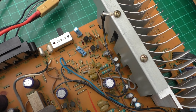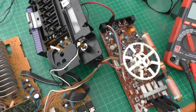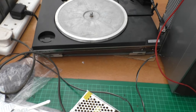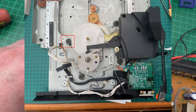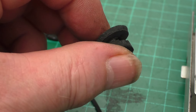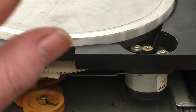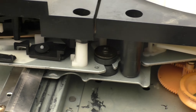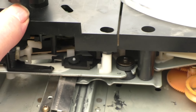My bodge works as far as getting it up and running. I've now put the correct zeners in from my trusty Amazon kit. Everything is in bits - the radio is actually working, the cassette is still eating tapes waiting for the belts, and the turntable is giving me a multitude of problems. Mainly these dampening rubbers - as you can see they're totally perished. There are four of them attached to the main arm and they give it a bit of lift and float. Unfortunately because they're totally rotted, it allowed this section to drop down onto the sliding mechanism plate.